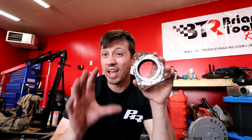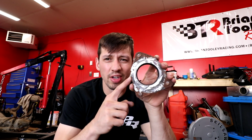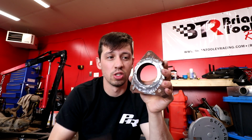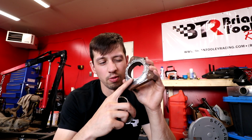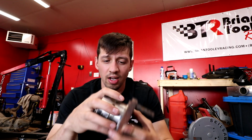So literally half the comments said I should preheat this, and the other half said I shouldn't preheat it because it's steel, not iron, like cast steel, not cast iron. What I'm gonna do is practice preheating it anyways. I'll just use the torch on it a little bit. Because this is such a thicker metal than this, I'm gonna try and focus my bead mainly on here and then move the puddle into this and see if that helps.